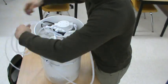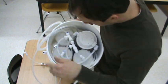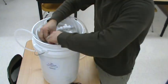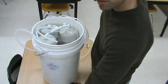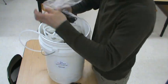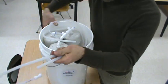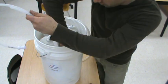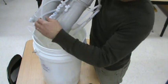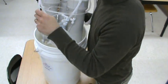In terms of using the bucket, you can get your transformer out of there. There's an extra pre-filter stored inside, and the transformer is usually stored inside as well. What you're going to need to do is go ahead and unhook your water filter housing using the push connects. Once you remove that, you'll have access to the inside of the bucket. You can pull your transformer out. These two hoses are now loose — they run right through the plate, so you can pick this whole thing up and have access to your whole bucket. Pull the extra pre-filter out. This is what you would do if you needed to maintain it, change the filter, or fix a slight leak.